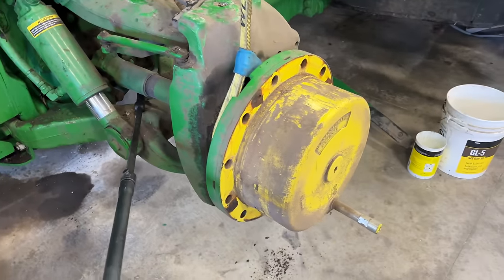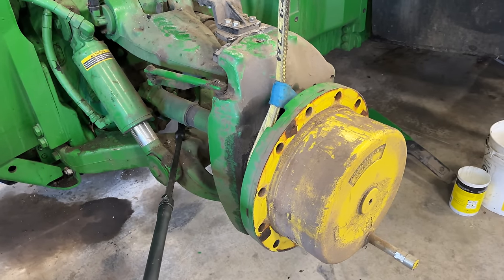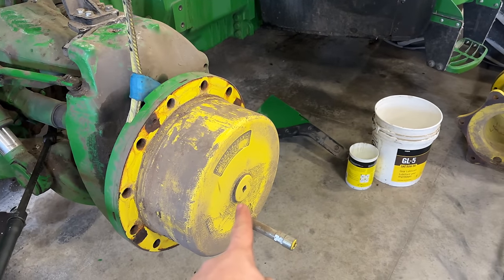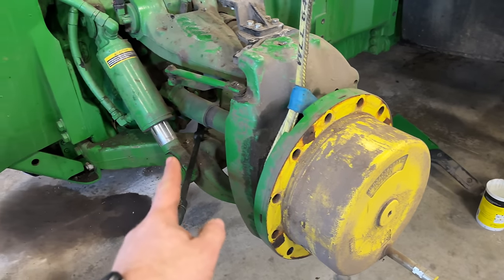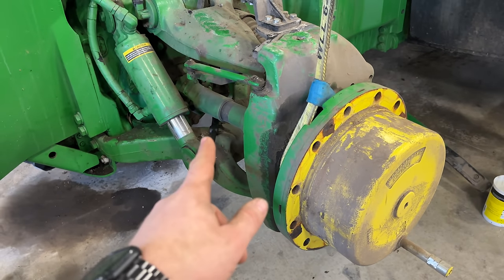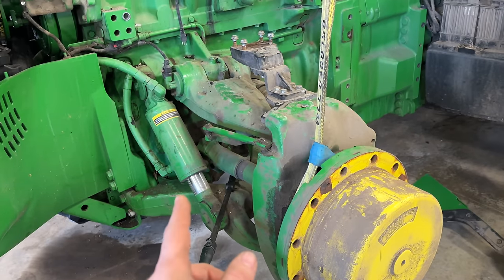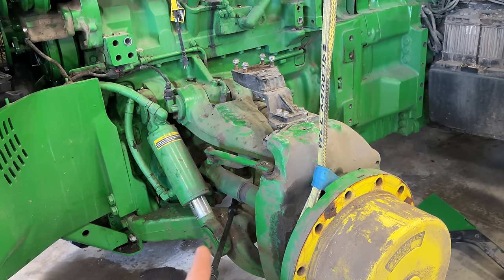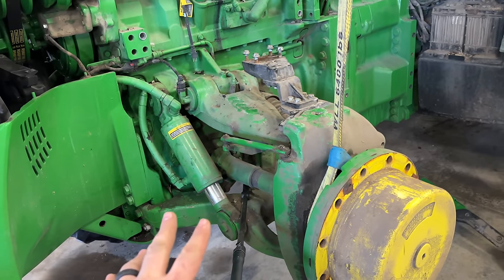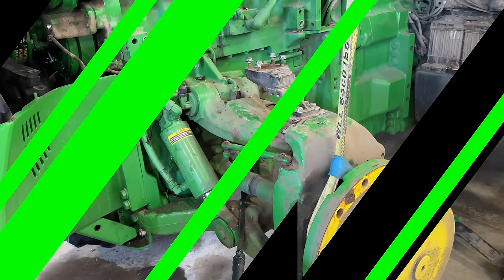But also, I'm going to drain this hub down so we can change the oil in that and we can take that drive shaft out. I got to take this center plug out to get the bolt out for the drive shaft. So the first thing I'm going to do is get this drained and get that ILS drive shaft out of there. But I think we're gonna wrap up this video and I'm gonna make all the ILS and MFWD stuff for the next video.